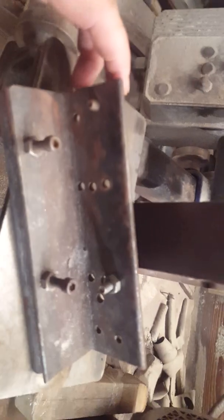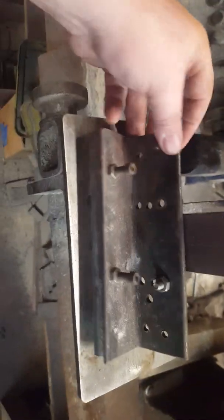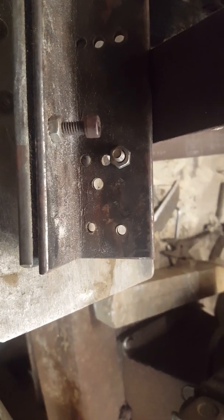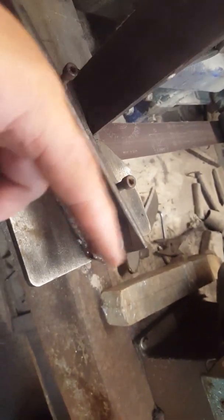And what I've got is super stupid simple. This is my grinding jig. This is a piece of 2" by 1/4 angle iron, and you want to talk about just crap jury rigged, this is the definition. On the sides, I have 2 tapped holes, not even laid out, just kind of where I put them, and that controls one socket head screw that's got a washer really crappily welded to it, and that acts to actually hold the blade.